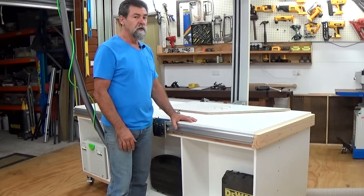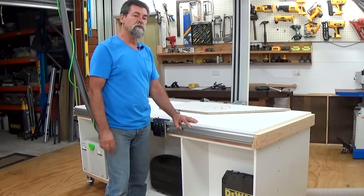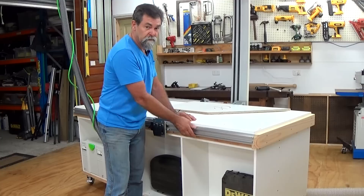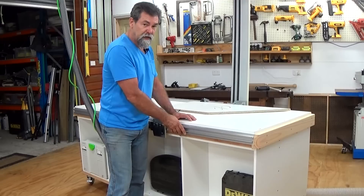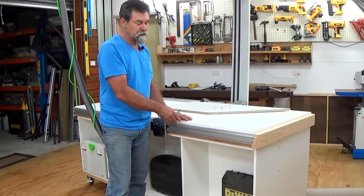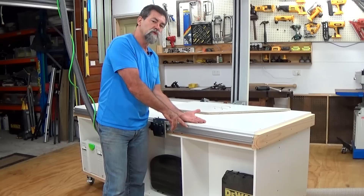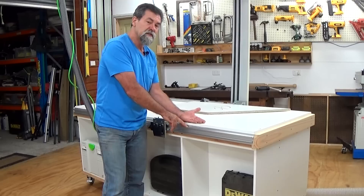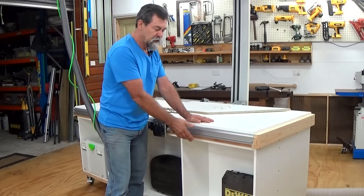It's on casters. They're all lockable, and I can wheel it into the corner of the shop when I'm not using it. The top is a torsion box, and it's got a few design features that I was really happy with. I spent a long time with this profile that Festool sell - and I bet a lot of you didn't realize you could buy this profile. It comes in two-meter lengths and they sell it as a pair, so four meters in length in total. It is designed to take the MDF top that the MFT3 has. MFT3 is multifunction table; MDF is medium-density fibreboard. MDF top, MFT3 profiles.